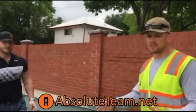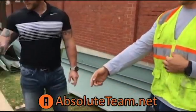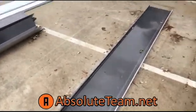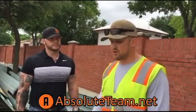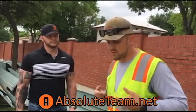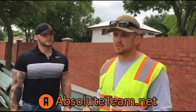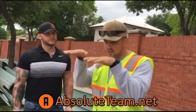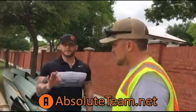The finished product of these metal panels is what you see right here. What these come in is 2,000-pound coils of metal, and these coils are then rolled through a roll former that creates the panel profile that we're trying to get. When these rolls are sent through the roll former, if it's not done right — and sometimes it's hard to prevent — a phenomenon called oil canning happens where you look at the panel and it looks wavy. And that can obviously be ugly, especially when you're doing a big, pretty job like this. Not aesthetically pleasing.